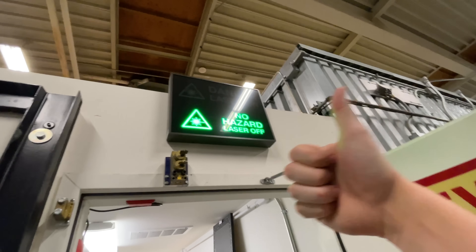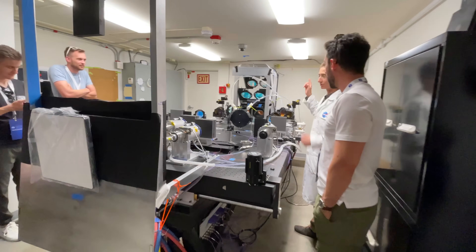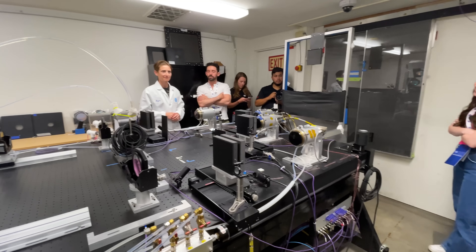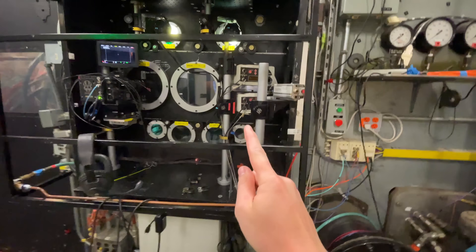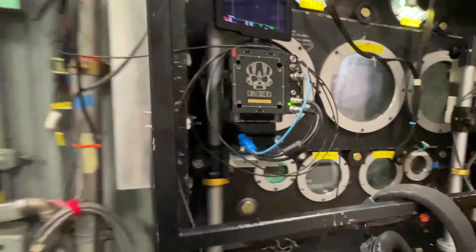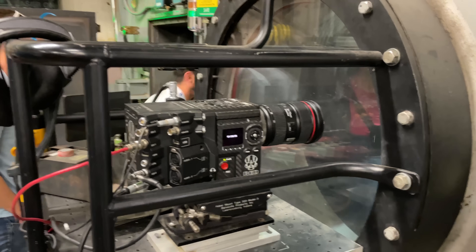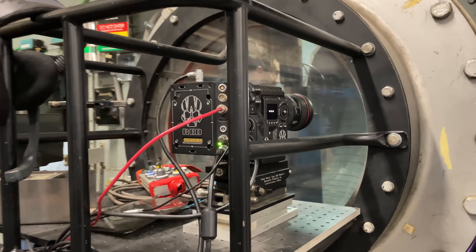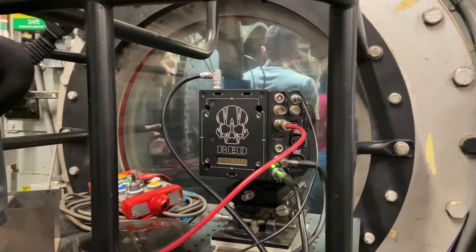Before we dive into the test footage — sometimes this isn't enough. Sometimes it needs to be hotter. That's why, adjacent to the ArcJet chamber, NASA Ames set up four 50-kilowatt continuous wave infrared lasers to boost the heating on the test sample. The beam comes out of a window, then through a port to heat up the sample. If you enjoy filmmaking, you'll probably recognize the camera used to film the samples as they ablate — it's a Red Weapon Dragon, or possibly a Red Weapon Helium.